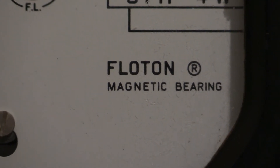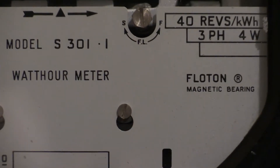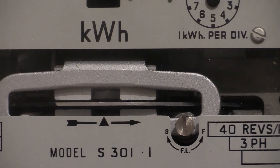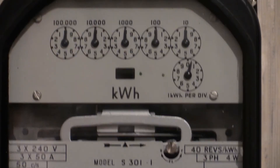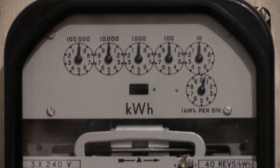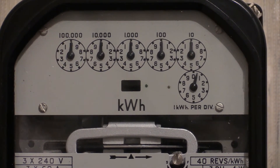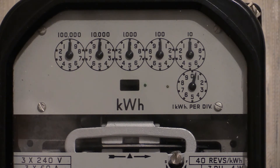The float on magnetic bearing refers to the load wheel — the load wheel sits on a magnetic cushion, so the accuracy of this instrument is maintained over a particularly long period of time. The readout on this particular example does not have a 0.1 dial. There are certain Sangamo S301 instruments which do have a 0.1, but in exchange they do not have the 100,000 dial at the other end. The dials read: one, ten, hundred, thousand, tens of thousands, and hundreds of thousands. If this meter starts at zero and works all the way back around to zero again, it will have registered one million kilowatt hours.